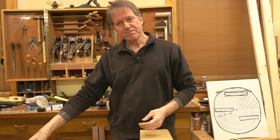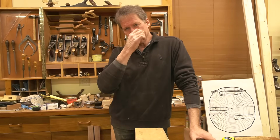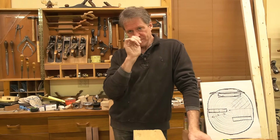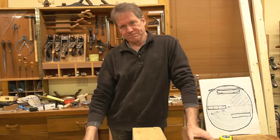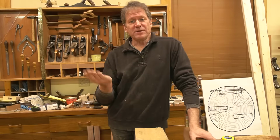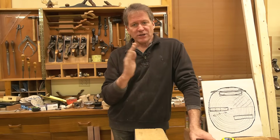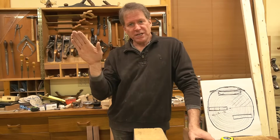So Armin's curious. He says, I'm building a new shop door. The stiles and rails will be the stave core construction, 2 1/4-inch skins of white oak, and the core is 1 1/4 inch. Should I go with the oak for the core, or is poplar okay? Oh, I think poplar's fine. I would try to flip the poplar up on edge, right? You're going to be laminating it with staves and then sheeting it over.